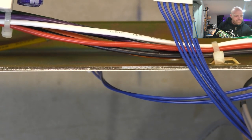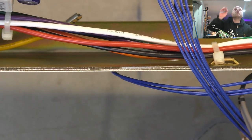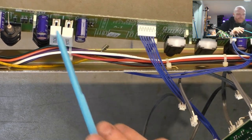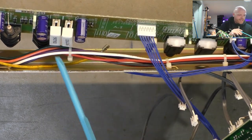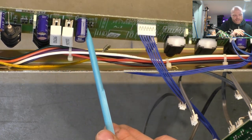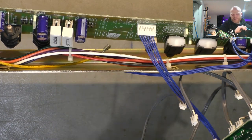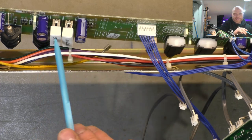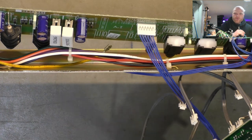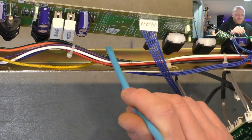ZD 1 and 2 have overheated and they've got 270 ohm resistors regulating. Oh, you can't see shit. Sorry. They've got two 5 watt resistors regulating and then filter caps. Those two diodes there up against the caps, almost like they planned for those caps to fail. And those four caps hugging these two 5 watt resistors, almost like they're trying to heat them up. There's plenty of room here. They could have spread stuff out, but you know, there's other options and stuff.